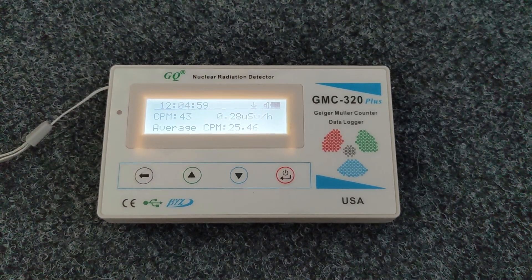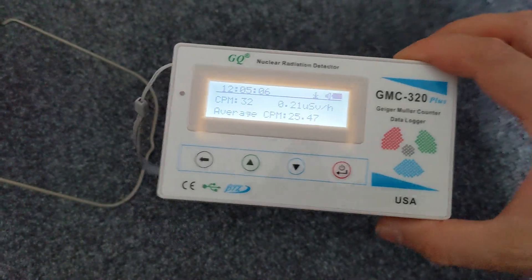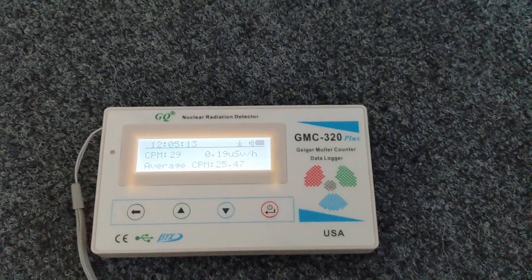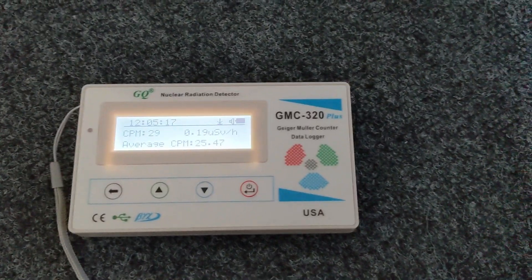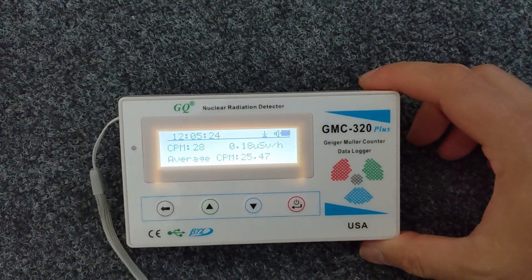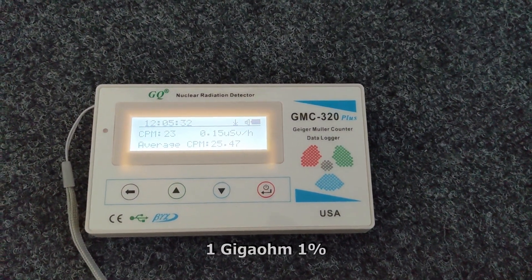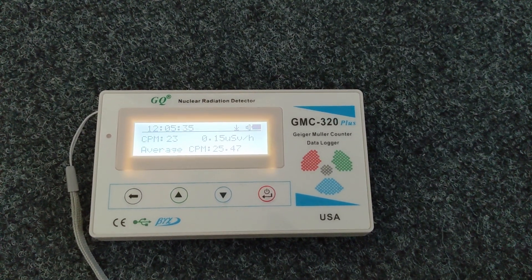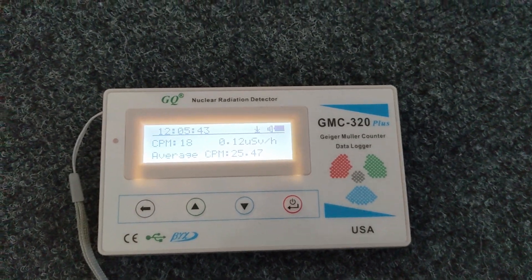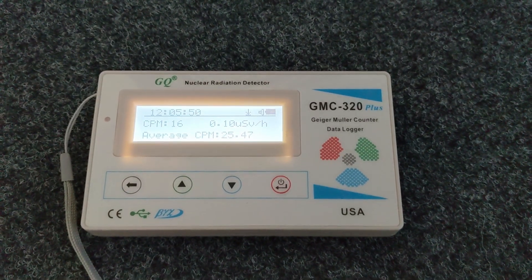I'm already rambling again without really having a clue. The plan is to replace the tube and hope that the light sensitivity disappears, and hopefully the electromagnetic interference sensitivity disappears too. I also checked the anode voltage with a measuring resistor and it's about 396 volts, which should be fine for these kinds of tubes — so the problem is not caused by wrong voltage on the tube. Thanks for watching, until next time, bye.